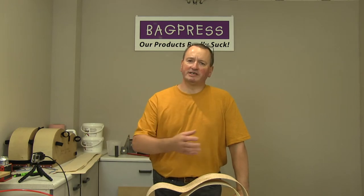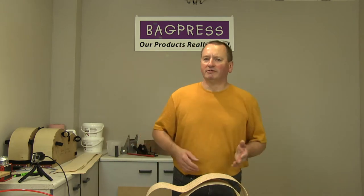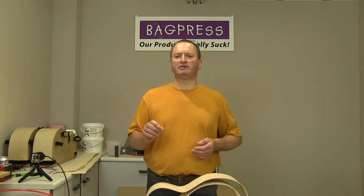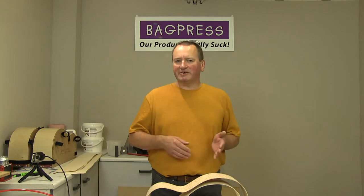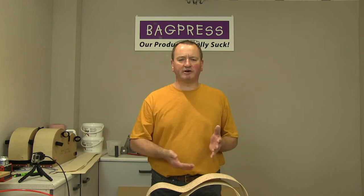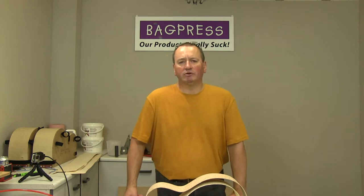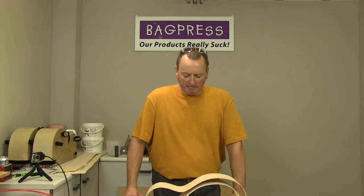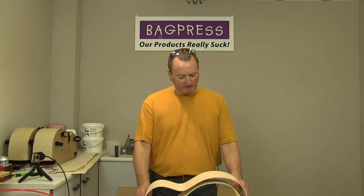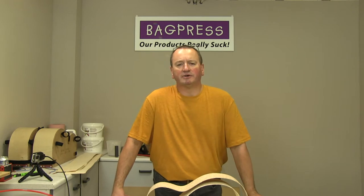The guitar maker is then taking that down to just over 2, maybe 2.5 mil. So again, you've got another 40% loss there. So for every 10 mil of material, you're losing 70% of it in wastage. And that's not the case with veneers. Like I say, knife cut veneer is a very, very efficient way to use rare and valuable and increasingly rare resources. Now, you could argue that if all the Rio rosewood that was in the world at one stage had only ever been used as veneer, it may still be readily available to us now as instrument makers.